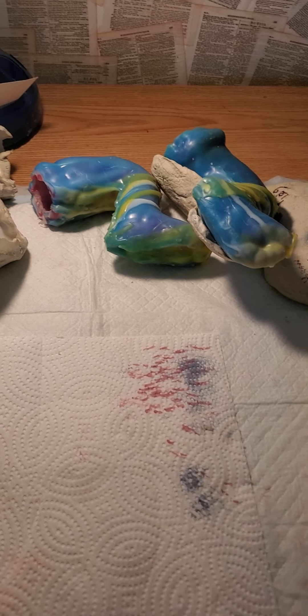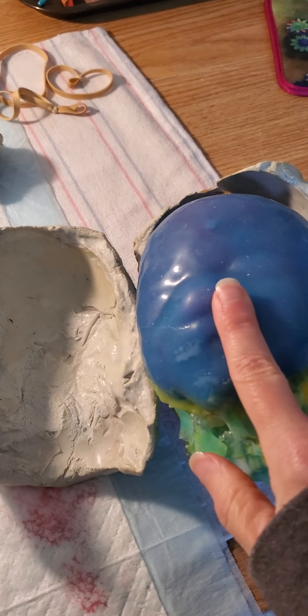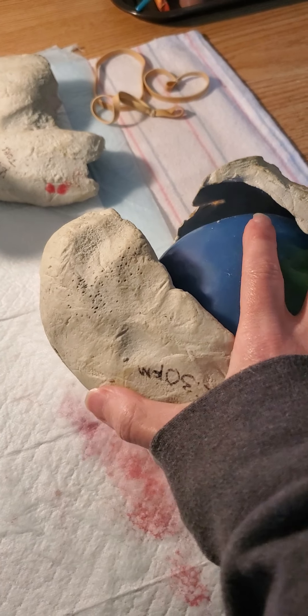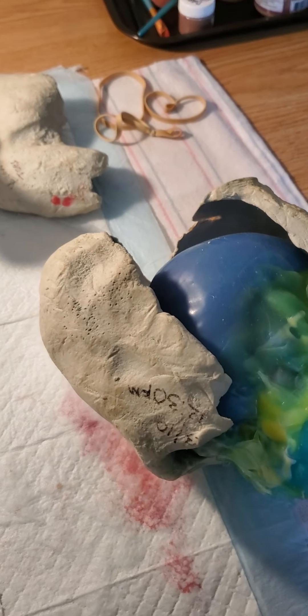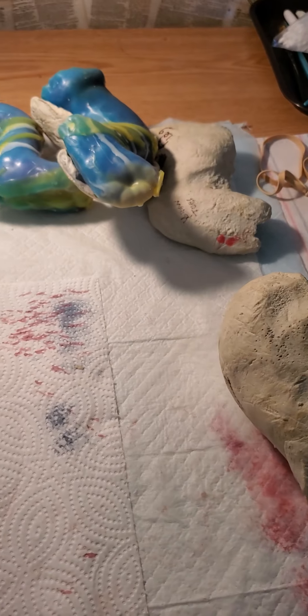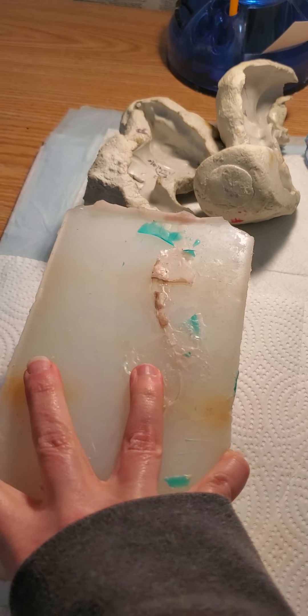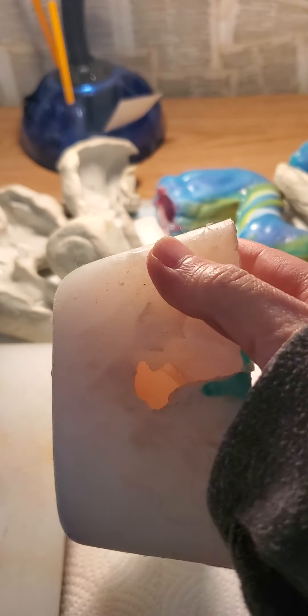So I just wanted to show you today what a silicone baby mold looks like. This is the glove mold, and over that goes the mother mold, which holds the glove mold snugly — just like a mommy would. The mother mold is the hard protective plaster. And then we've got a block mold for the arms, and you pour the silicone into that hole.